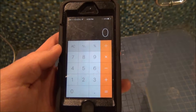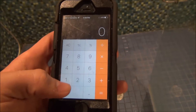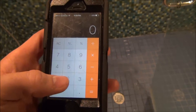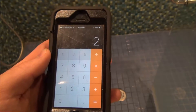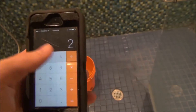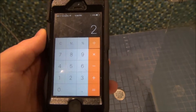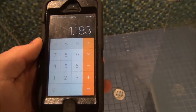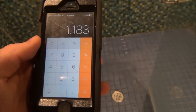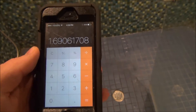I also wanted to show the calculations for the gallons per minute at my shower head. Basically, you want to take the two US gallons of water that the bucket can hold and divide that by the time it took to fill the bucket, which I found was 1.183 minutes. So two divided by 1.183 gave me about 1.7 gallons per minute.